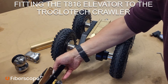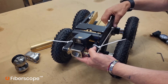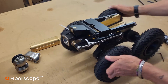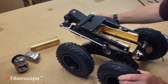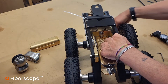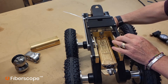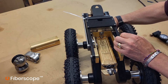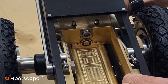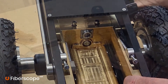The elevator will be supplied with a tie wrap so it won't expand. Put it over the top of the crawler — turn it around so you can see — so that it's over where the battery connector normally goes. It has to go back far enough so that the large screw at the front connects to where the camera usually goes. These screws might impede you, so lift it up and push it back slightly and make sure that it can go backwards.